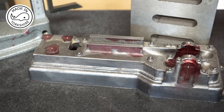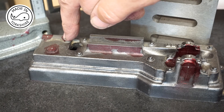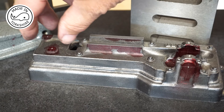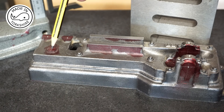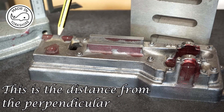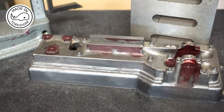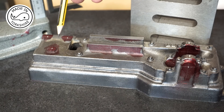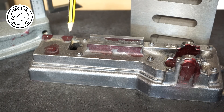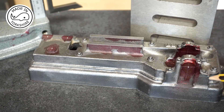The angle plate's arrived and I've marked up the main bearings. I've also marked up the position where the screws will come through to hold the cylinder on top of the sole plate. The distance between the holes is supposed to be half an inch, but half an inch puts it out too far. So I've changed that measurement so both measurements are now 7/16ths from the centre position. I don't think it's that critical because you can define where the holes will be drilled in the cylinder when it comes to it.